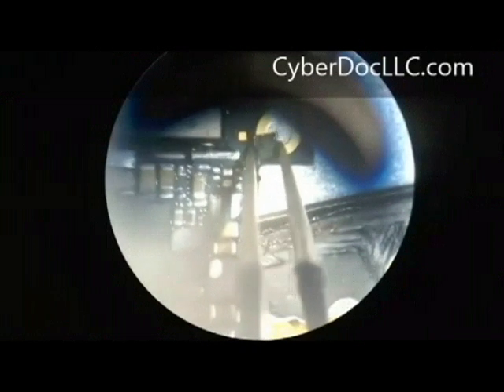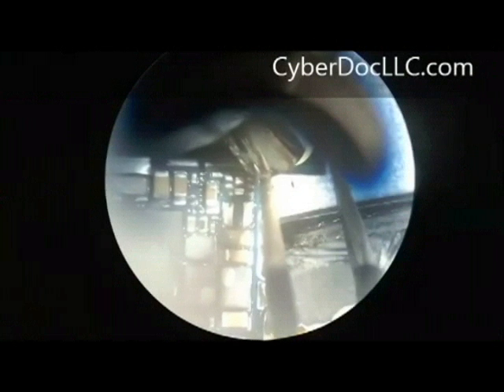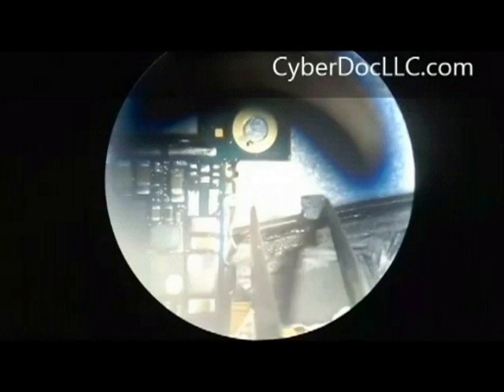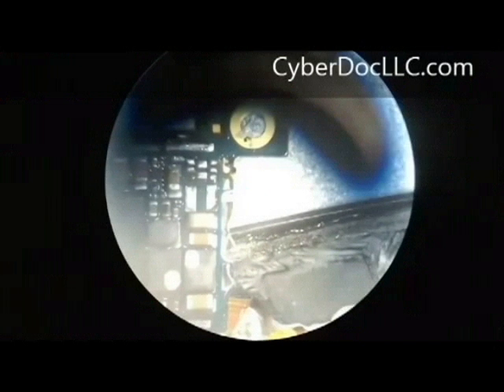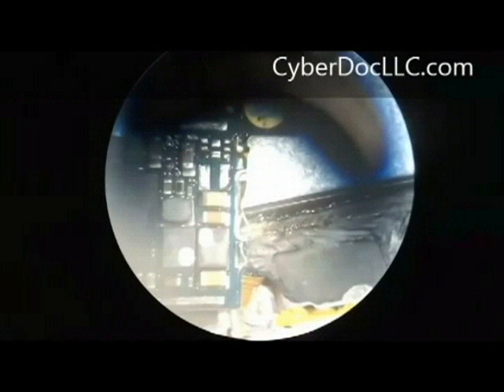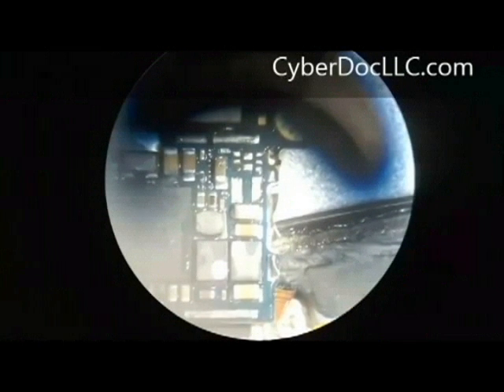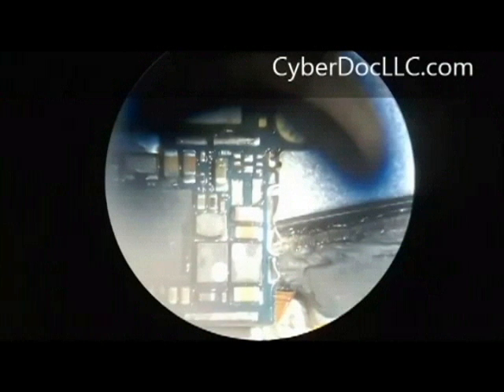There are 6 pins on this IC, and I just heat-gunned it off the board. I was a little worried because I put a little too much pressure with my tweezers and it looked like one of the pads got lifted. But later on I found out that wasn't the case — the pad wasn't damaged. Instead, the IC itself broke off a little bit, so that little black piece you see is blocking one of the 6 pads from the IC. It's part of the IC that got attached and broke off onto the larger board. So the larger board itself is fine — the track is there. That's actually pin 1 that's being covered by a piece of IC attached on the large board.